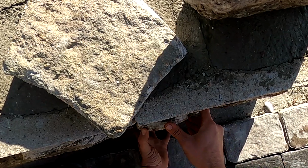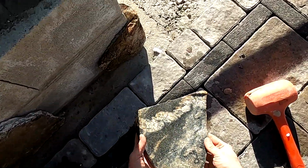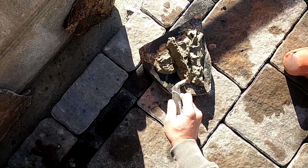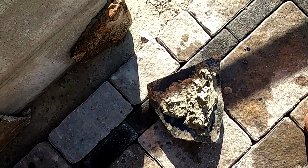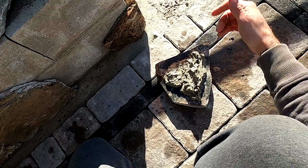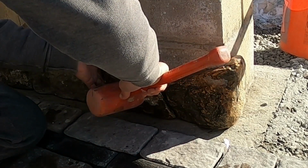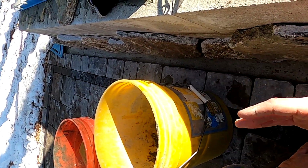So it's good to check your pieces where they're going to be sitting. Like this piece right here is thinner on this side than it is this side, so I need more mortar over here than over here. When we're putting the stone veneer on, we're not just trying to back butter it even on the back of the stone, because the thicknesses vary a lot, every stone. So you gotta really set it in place to where the face is really supposed to be. The thin ones you need a lot behind because it brings it out forward to compensate for the very thick ones.